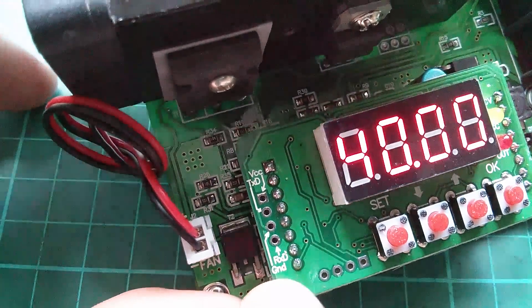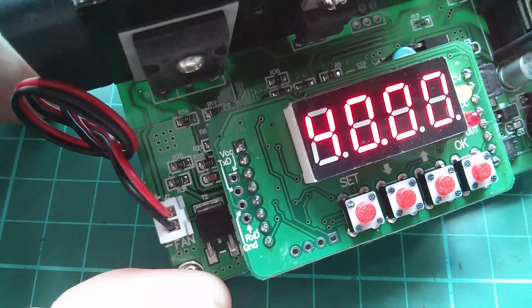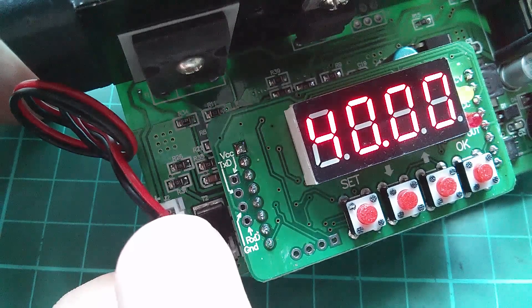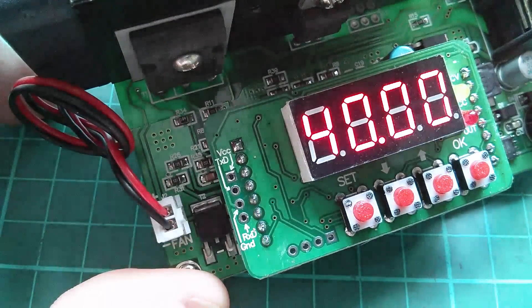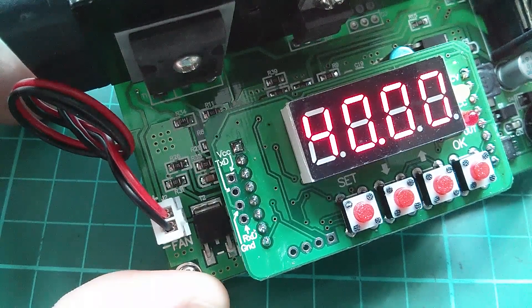This thing has TX and RX pins on the four-way connector. So when I've got a bit more time, I'll check whether there's any serial data coming out — TX, I suppose — and whether it accepts commands going in. But I'm not going to do that right now.